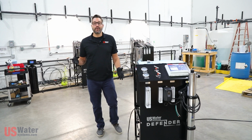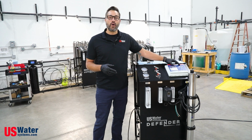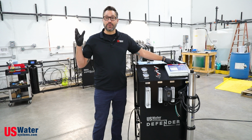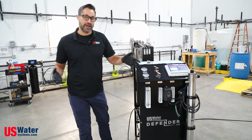So how do I know when it's time to change my RO membrane? Well, when your quality indicator here falls below 90% rejection, which is the difference between the incoming TDS and the product water, it's time to change your membranes.